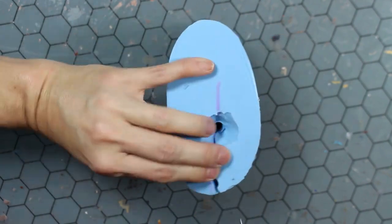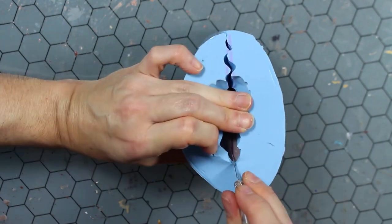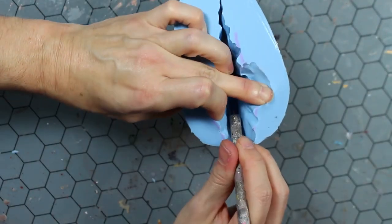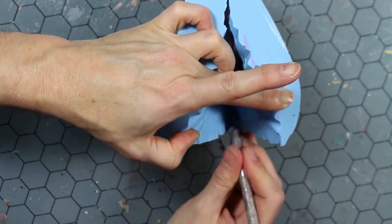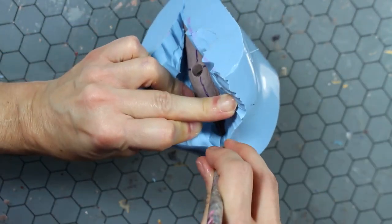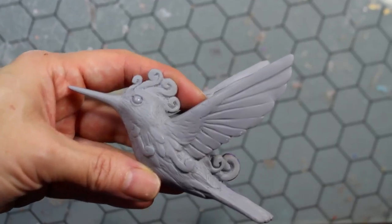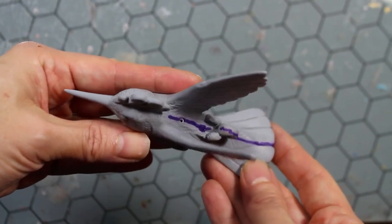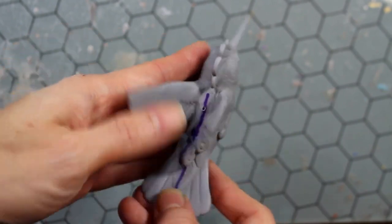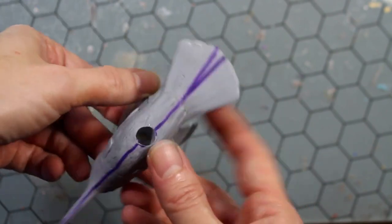When you're cutting open molds you always want to use a zigzag pattern up until you reach the seam line, where you will create a straight cut. So straight along the seam and zigzag away from the seam. This is the waste mold, which will just be used to get one cast which I will then polish up to create the final molds. This is what the waste cast ended up looking like — it is all nice and polished, sanded down really good. And again I created a second mold from this for the final casting — I'm not showing that process because it's redundant.